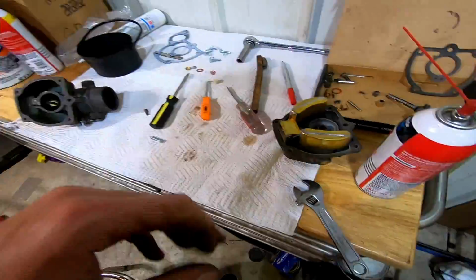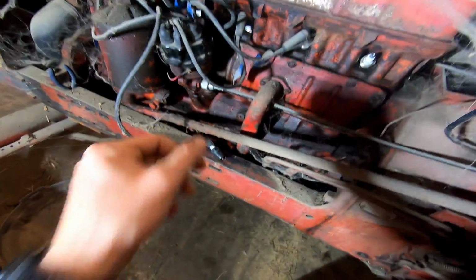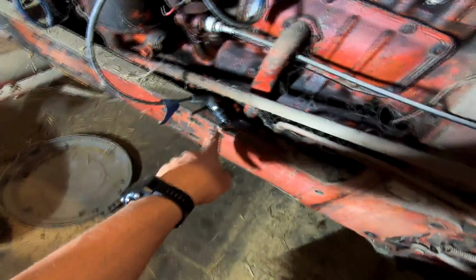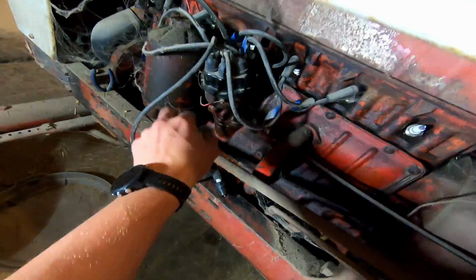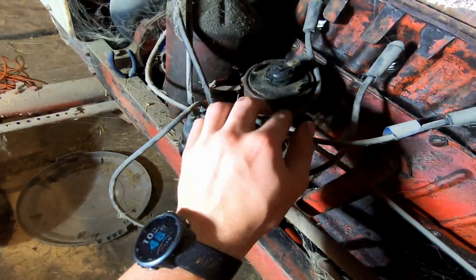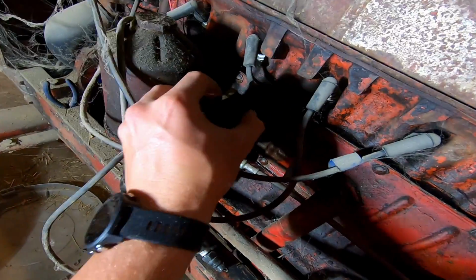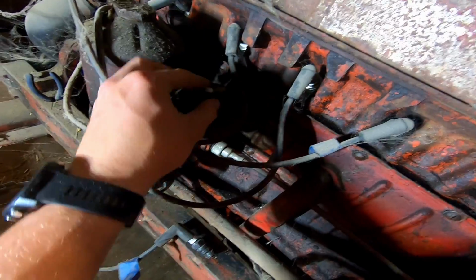So she's minty. Well, it's real dark outside, but we got light. So it wasn't sparking. I popped the cap off. I did this little test here with the spare spark plug. So it's still in, but it wasn't sparking. So pop this bad girl open, which I think is on backwards because it's not sitting down keyed well, but sander right there in the points. So she's now sparking, and I'll give her a test here.